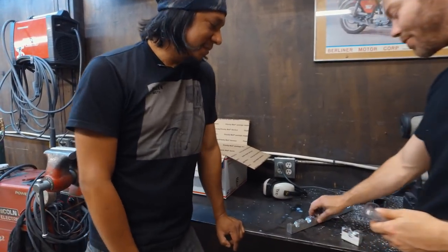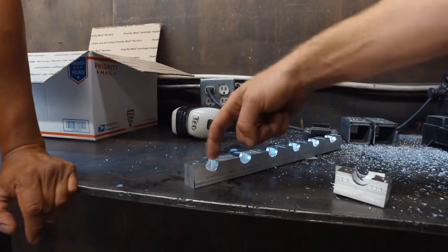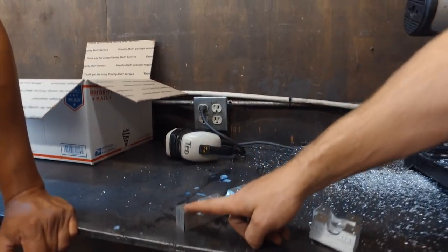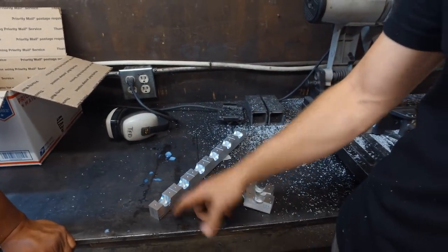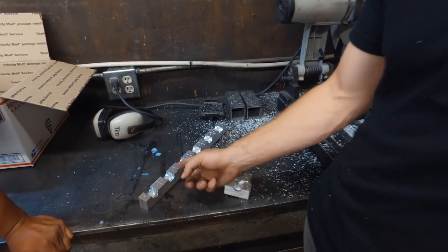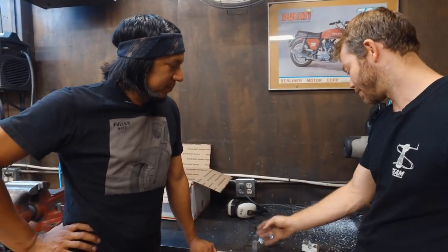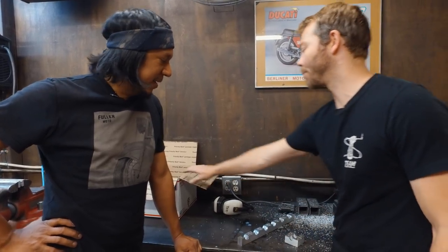This is the first stop of machining our switch housing, so that does a little pocket, drill, and thread, which we talked about with our thread mill one time before. And then we do it in bar stock, and then I come in here and cut it. I have an op that does a little saw mark, so I don't have to measure or do anything, and just chop them up, put them in a box.